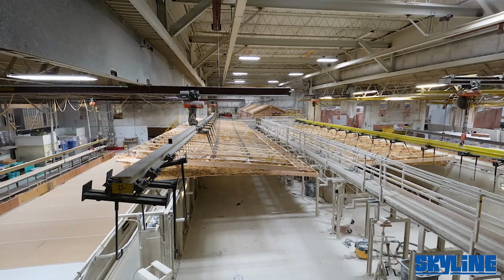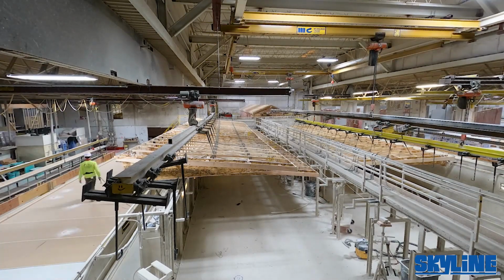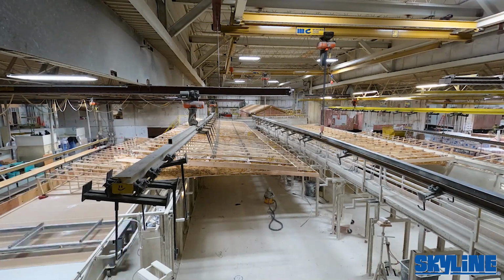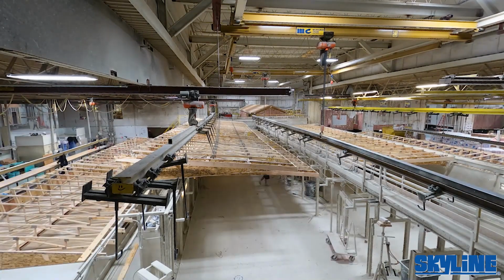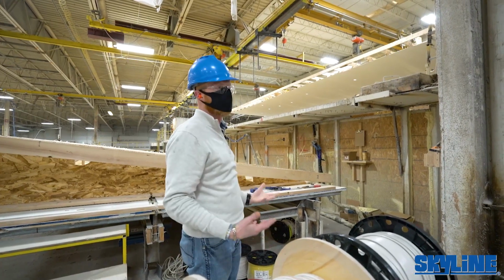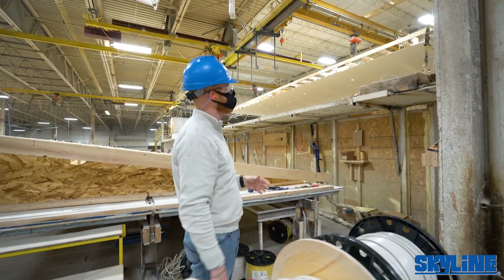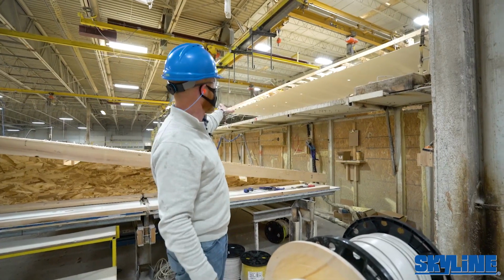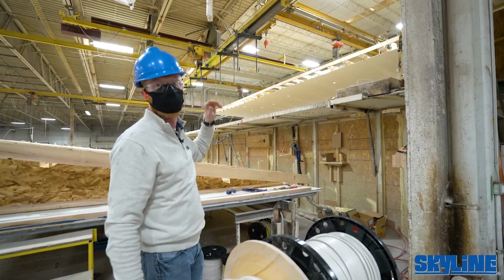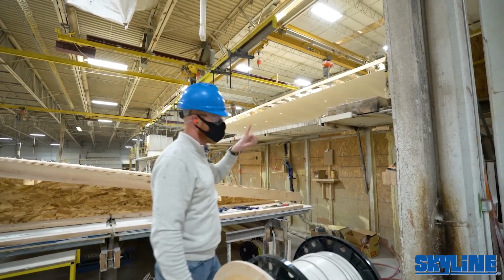and as you can see over here is a suspended roof. That's one of them that just came out of the mud pit. So when they get done with this, they lay it into the mud pit. And we'll be able to take a look at that here in a second. Basically, it gives the workers the ability to work flat-footed on the ground and mud these factory seams. You'll notice there isn't any cross seams. We buy our sheetrock the size we need to cover the span we need of the floor width we need. So we'll take a look at that, get a sneak peek.